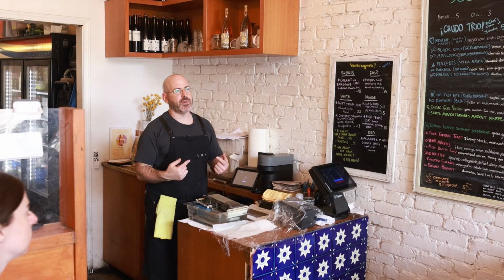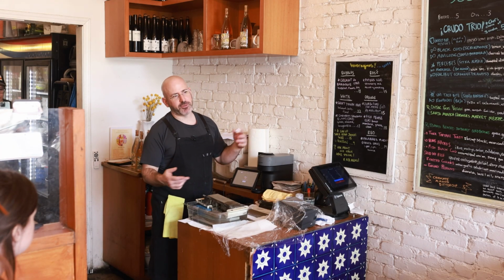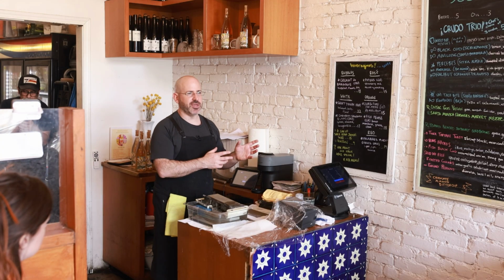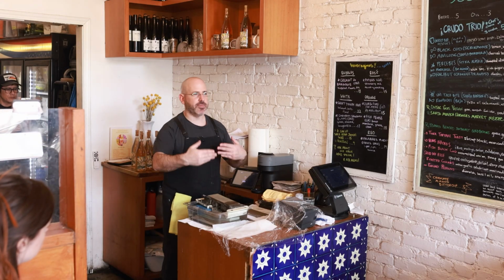So I don't generally recommend people start there because unless you feel really comfortable with your sharpening, you're probably going to mess some stuff up. So even taking more time on a medium grit stone, though it may not be as pleasant to spend that much time on something, will be helpful because you can see the mistakes coming before it's too late, and you can do something about them.